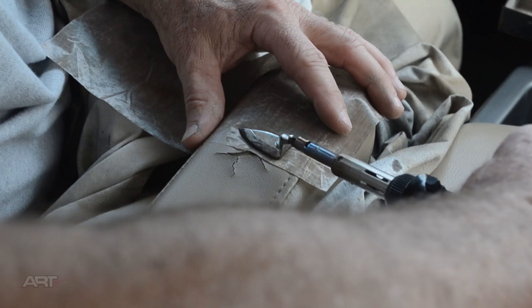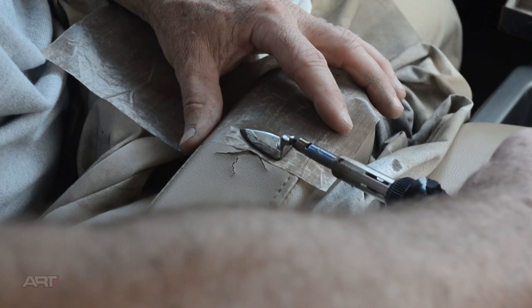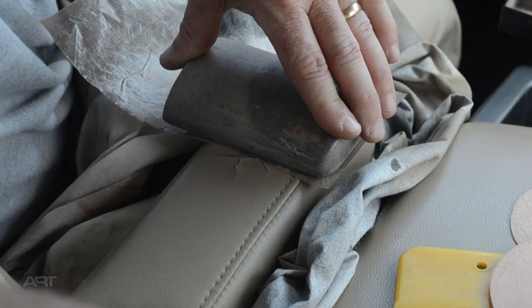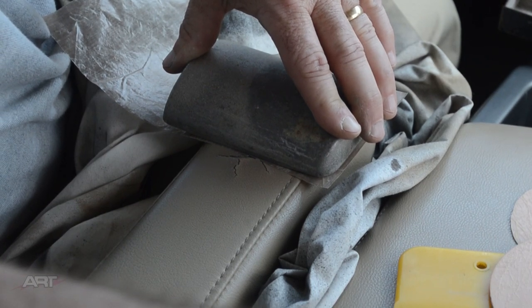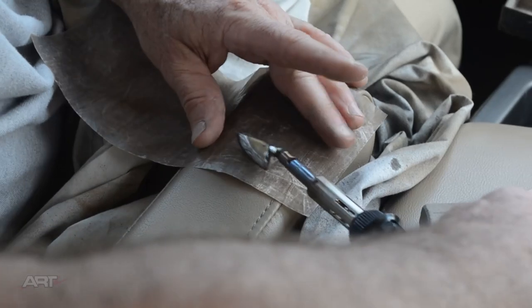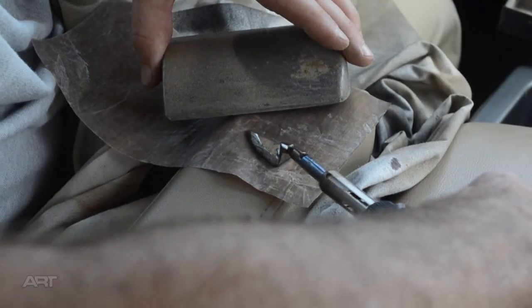The Teflon paper is designed for maximum heat transfer. Try to avoid the thin silicone pads here because silicone is an insulator. The important thing is not where the vinyl is when it's hot, but where it lies when it's cooled. So we need to make sure that we use the chill bar. We've been successful in flattening the vinyl, although just a little bit below grade — and that's good because that leaves us some room for the vinyl repair compound.